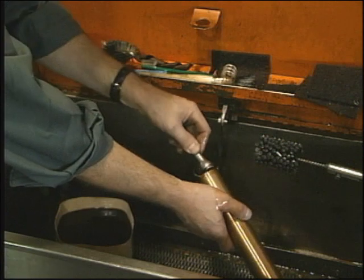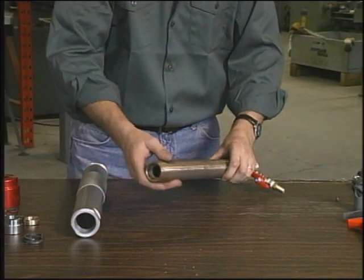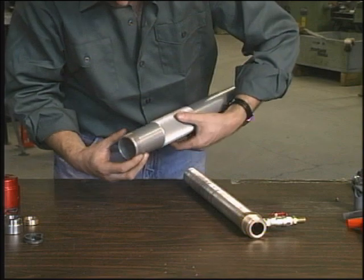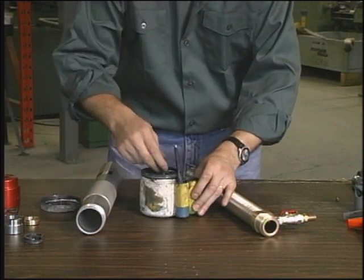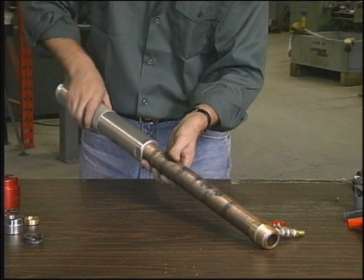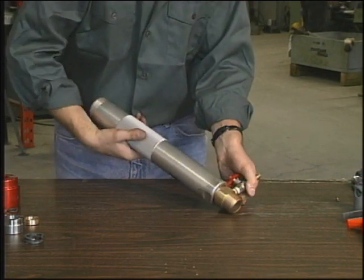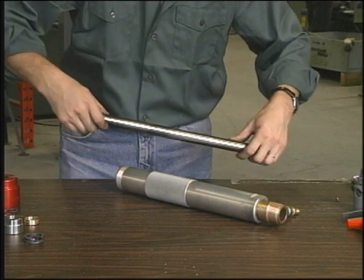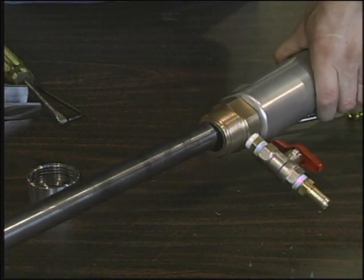If needed, wash parts in a degreaser tank and wipe clean. Seals cannot be washed and reused. To assemble the tool, inspect the feed screw and sleeve for any damage and replace if necessary. Lubricate the acme threads on the feed screw with grease. Turn the sleeve clockwise onto the feed screw until all the threads are hidden and the tool is fully collapsed. Place the tool horizontally on a table so that the parts do not fall out. Inspect the spindle for any damage and replace if necessary. Insert the spindle into the adapter end of the feed screw, hex end first.